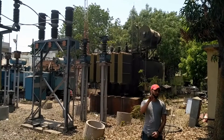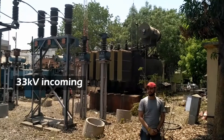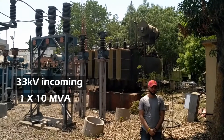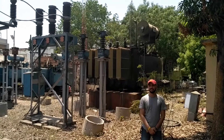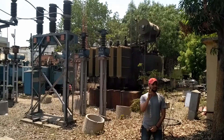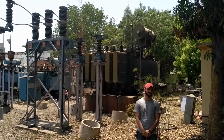To summarize this substation: we have one 33 kV incoming line, which has three tappings connected to two 5 MVA transformers and one 10 MVA transformer. After this, the power is given to the 11 kV feeder which distributes electricity along three different areas. So this was the 33 by 11 kV substation walkthrough.